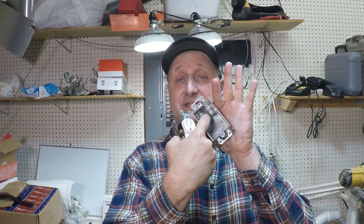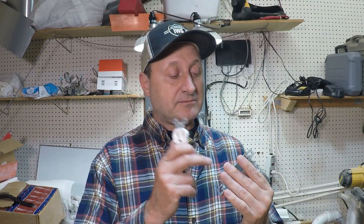So if you've got the ground wire attached to the back of the box, and the wire pops off or bends and touches both the brass screw and the box, the power will reach ground — it will not go into you. It's going to go back to the electrical panel and find ground that way.